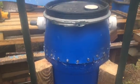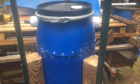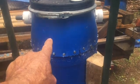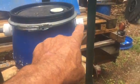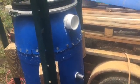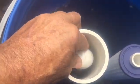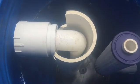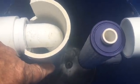As I'm going to show you, it's really two 15-gallon drums. This is the top cut off of one put on the bottom, and this is the top down here. Water will come in here, and I've got a tube that will direct it to go down. Hopefully, the dirt will settle out in the bottom. Then I have my usual filters coming up. This is the overflow pipe. On this side is where the filtered water will come out and go into the catchment system.